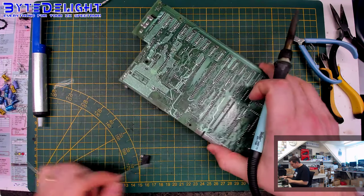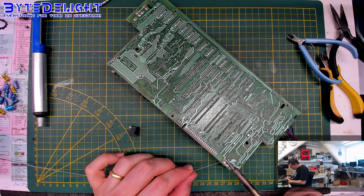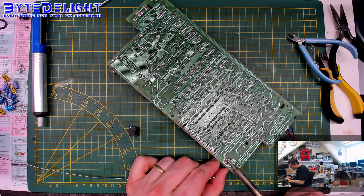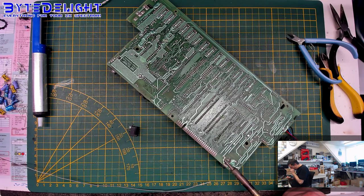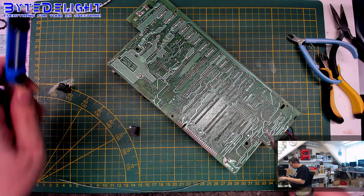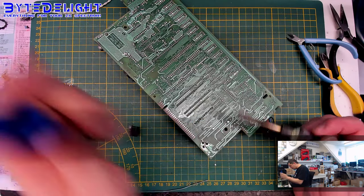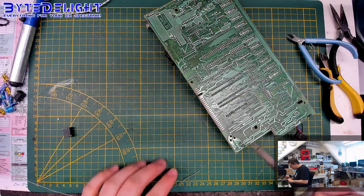And these sockets need some attention, because the new ones that I'm putting in, and the old ones as well, by the way, they easily melt. The plastic melts at very low temperatures, so make sure that you're not heating it up too long. And for the old one, it's not a big problem, of course. And make sure you're using 5.5 outside diameter and 2.1 inside diameter plugs, sockets, and not any other type, otherwise the plugs won't fit. It's a bit hot here.